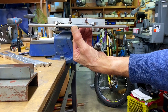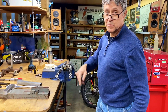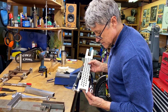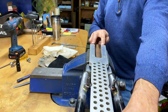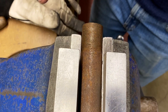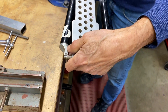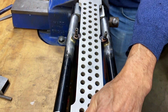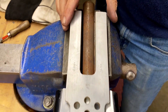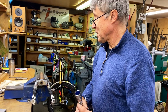Okay, I'm going to call that good. Now we have to make sure each leg is the same distance from the crown — that's what this fixture does. You put it in here and it's a little wider than 100 millimeters — you can see it's equidistant on each side. If you want to double-check the fixture, you take it off and put it on the other way — that's how you know if your fixture is good. The fixture is good because it's right in the middle. So that fork is basically aligned. Thanks for watching — I appreciate that. Maybe you'll want more.